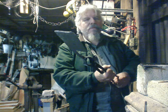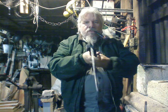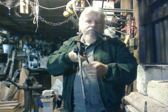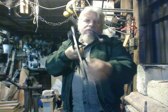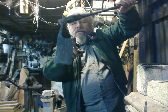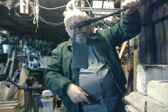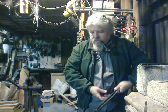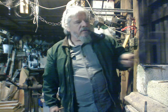You can see on the spine it's a lot thicker right in here — I need to draw that down. I'll cut this off a little bit and draw this out. There'll be a wee bit of an arc here, just a degree or so, and I'll probably have the same mark in the back. It's gonna be a nice one when I'm done.